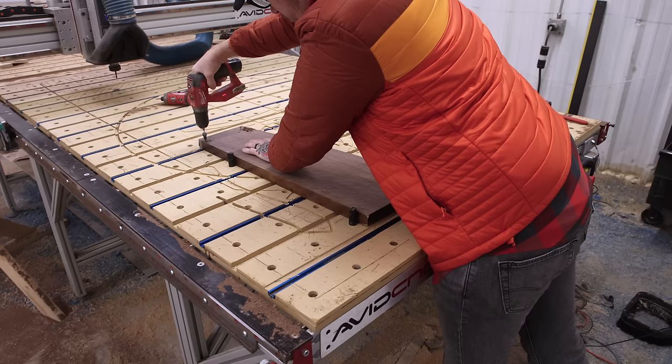There's a process I've been wanting to try for years: steam bending wood. That's why I've got boards prepped, a PVC tube, and weirdly a bottle of Downy fabric softener. The wood I want to steam bend is kiln dried, and normally you'd do this with green wood — but what I've read is that with kiln-dried wood you need to soften the lignin fibers within the wood using water and Downy fabric softener. I'm soaking the four boards for a couple of days to hopefully give myself the best chance of a successful steam bend, because from what I've read it's really easy to crack these things as you're trying to bend them.